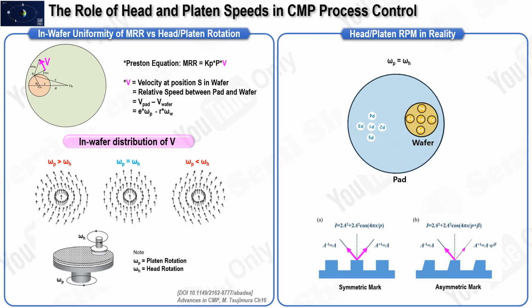This means that as the wafer rotates, each polishing point on the wafer maintains the same velocity magnitude, but the direction of the velocity vector shifts. Over the course of one full rotation of the wafer, this ensures that no specific direction is favored, leading to uniform polishing across the entire wafer without any directional bias or asymmetry.